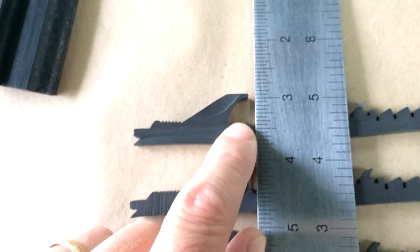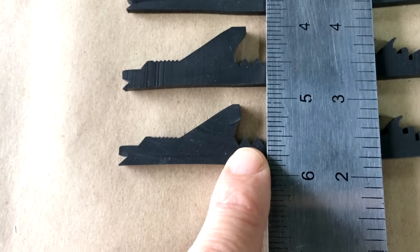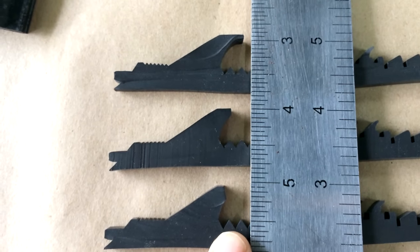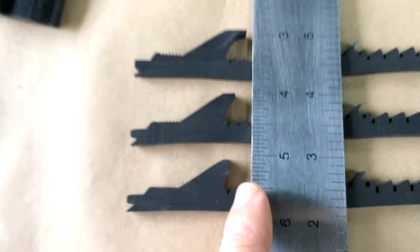Sometimes people say that the area right in here on my scrubber mat is not active enough. Here's a good example of how to change that. If I went really low, I've cut even more off — you can see the difference in those riffles. I've put a straight edge on there so you can see we're stepping it back and stepping it back.